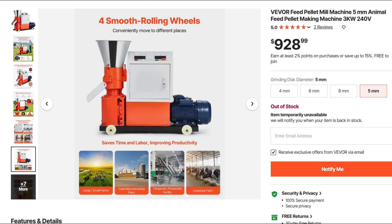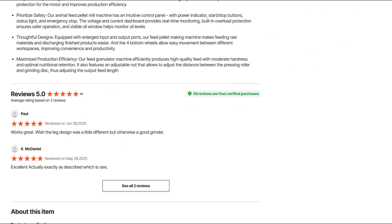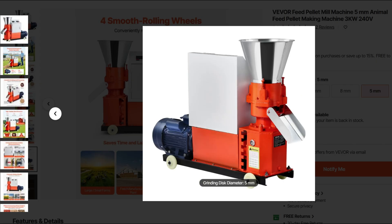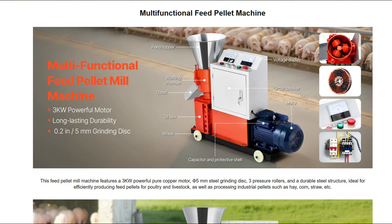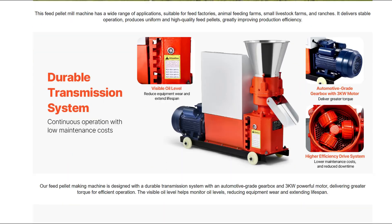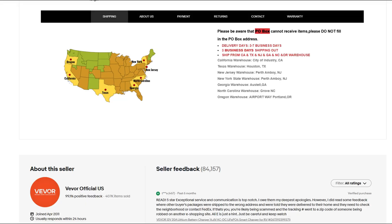As we peer deeper, the manual lays out some practical expectations. Yes, it can crank out pellets that store well, resist moisture, and may even kill pathogens with compression heat — but only if you respect the humidity rules. Raw materials need around 8–15% moisture, and a proper oil-in-gearbox ritual, or things go haywire fast. Your last brain cell just died imagining sludge in that gearbox.